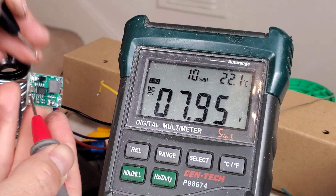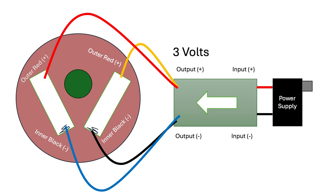Input is 7.96 volts. Here's a diagram to show you the wiring for the second generation August smart lock. On the upper outer leads, connect those two wires to the positive end of the voltage adapter. On the inner lower leads, connect to the negative part of the voltage adapter. The voltage adapter should be set at 3 volts. For the third generation, you don't have this dual-battery-per-slot issue, so you just connect to the upper and lower leads — still set it at 3 volts.